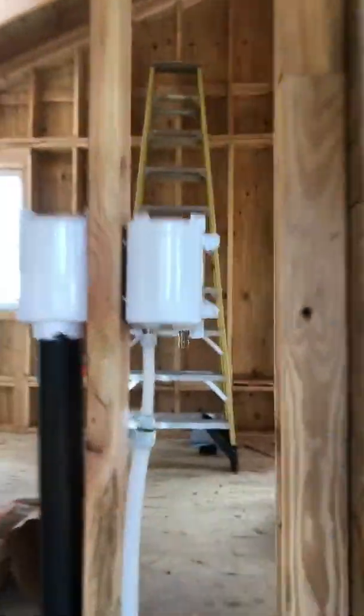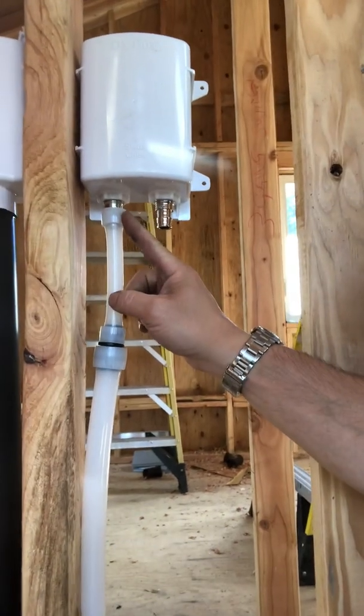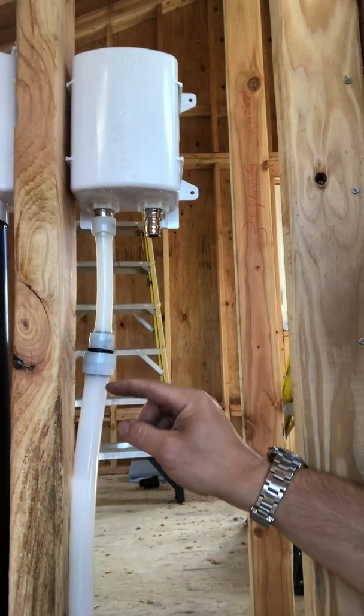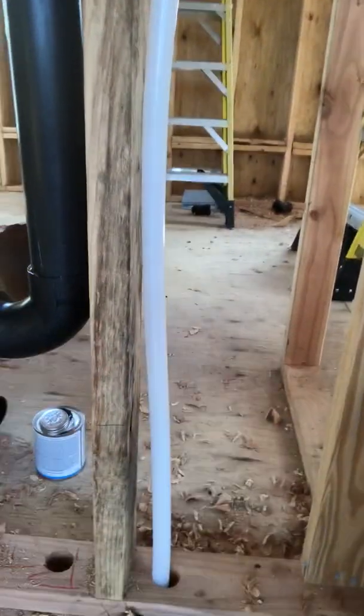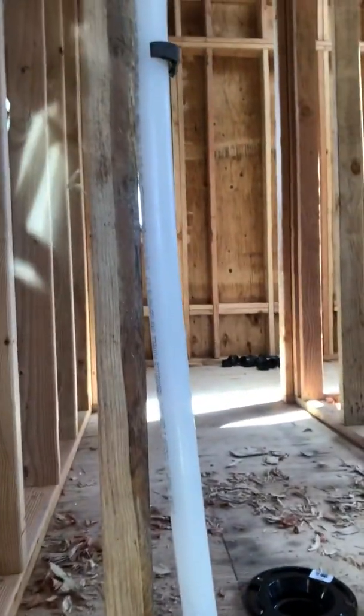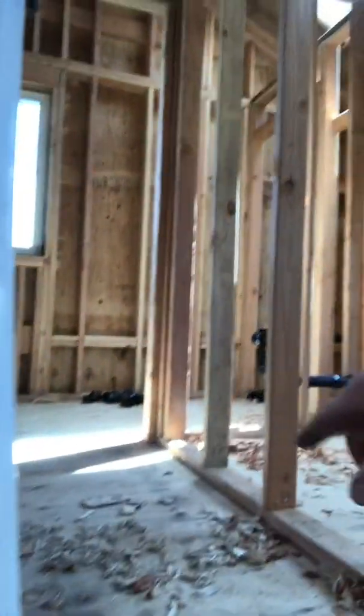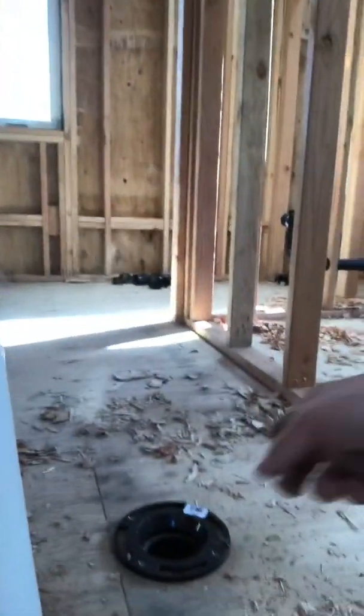Get yourself some pipe and you can go to town doing simple plumbing jobs like this — it's very fast. You've got your half-inch feed line here for a washer. I have a reducer from three-quarter to half. Personally, I'm running as large a size as possible to the end run so I have as much water supply as possible — one-inch supplying most all the other fittings, then it reduces down. Here we have one inch going up to the hot water heater, and we'll tee off with a one-inch to half-inch tee that'll come and feed the toilet. So just a brief introduction — enjoy.